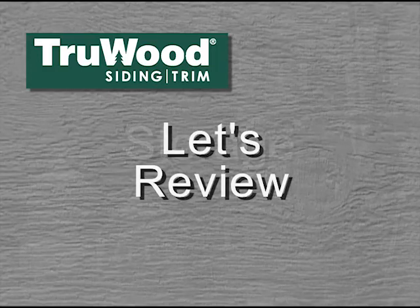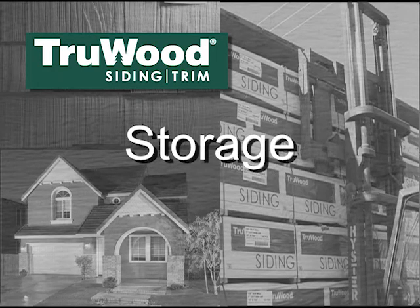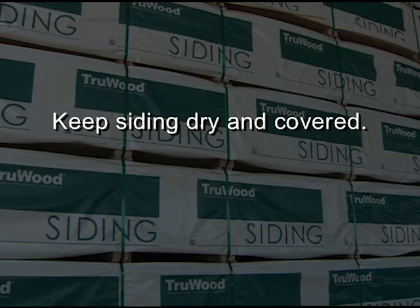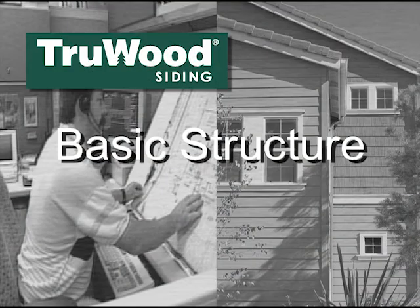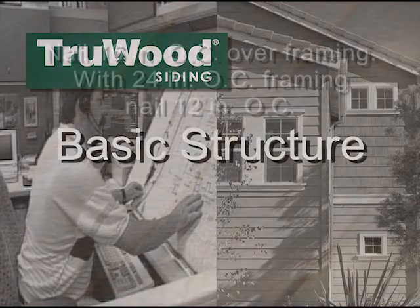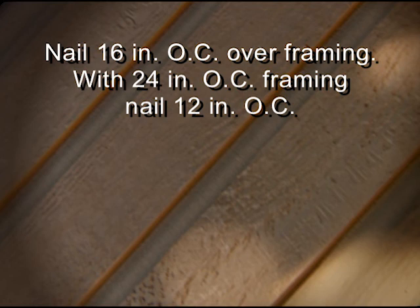Let's review. Handling and storage. Keep siding and trim dry by keeping it covered until it's applied. Keep stacks off the ground by elevating them with stringers. Basic structure. Standard framing for TruWood siding products is 16-inch on center. If 24-inch on center framing is used, intermittent 12-inch on center nailing is required.